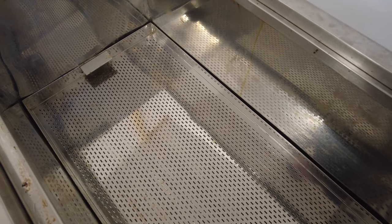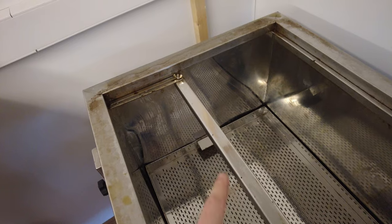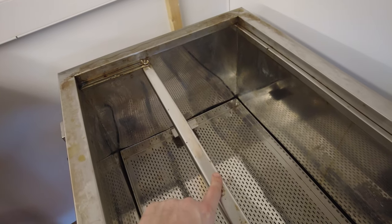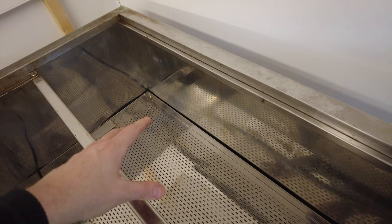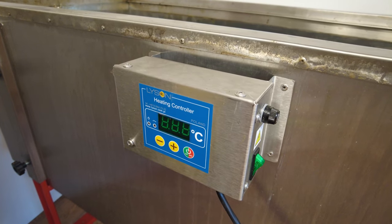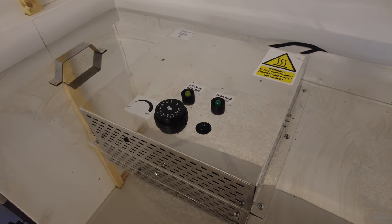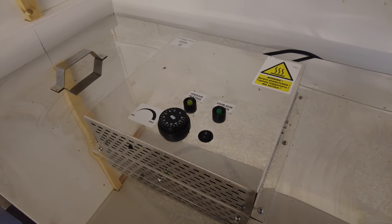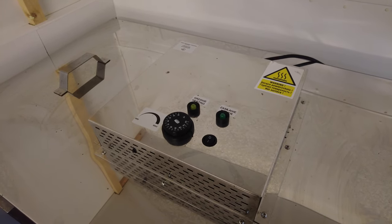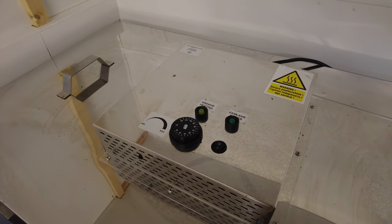It's due a little bit of a clean — it gets cleaned at the end of every season. It's got a stainless steel mesh at the bottom; you chuck all your wax cappings in, melt it up, and it goes out of the outlet at the bottom. There's a handy bar across the top so you can rest your frames and let honey drip out, using it as an uncapping tray as well. The side controller goes up to about 75°C and the top controller goes up to 120°C. We tend to run it at about 70°C, leave it overnight and everything's melted.